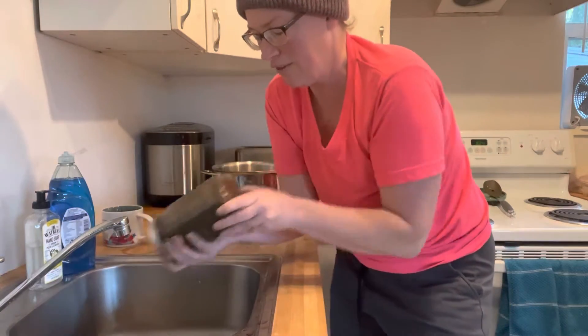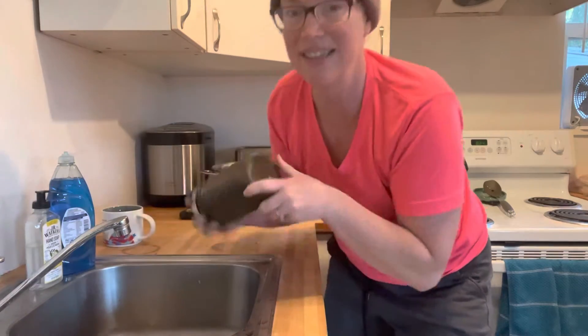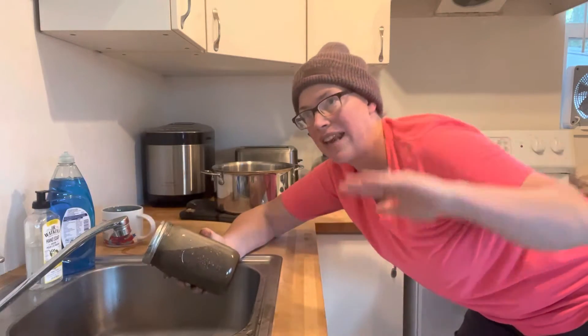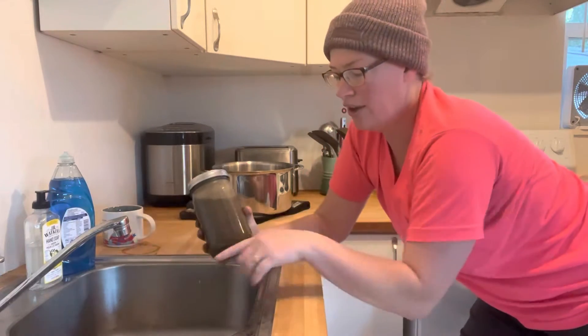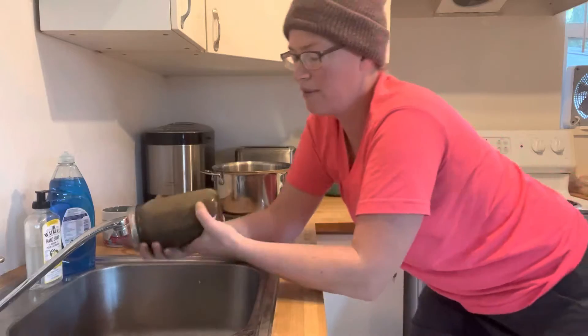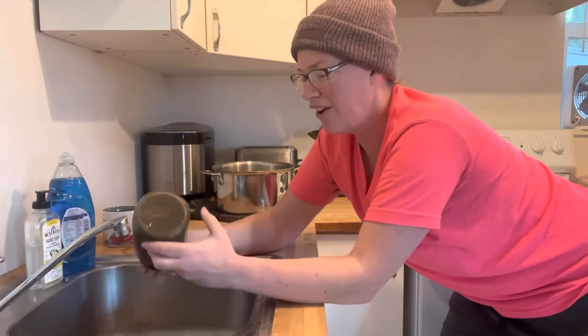The theory is that over the next couple of days, the heavier pieces will settle on the bottom — that'll be your sand. Then based on density, the silt will sink down and layer on top of that. And then over the next two days, the clay will layer on top. So you'll be able to see the distinct layers and calculate the percentage of each. I'm going to keep shaking this, get it onto a countertop where it won't be moved, and I'll be back in a couple days to test it out.